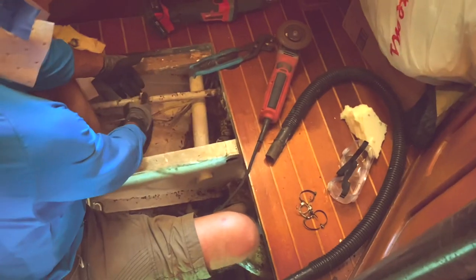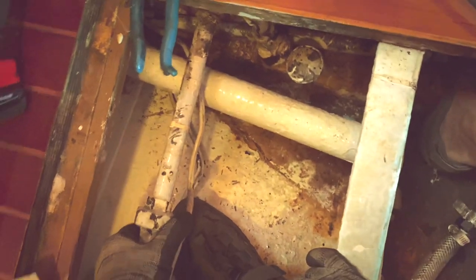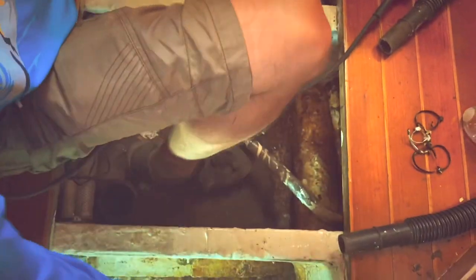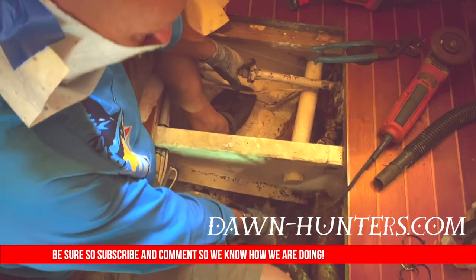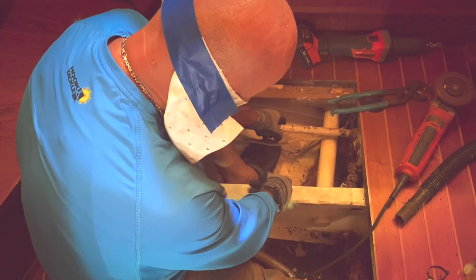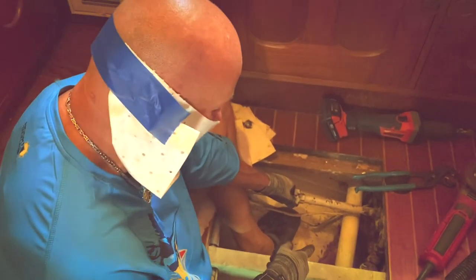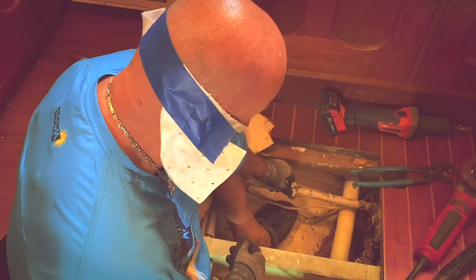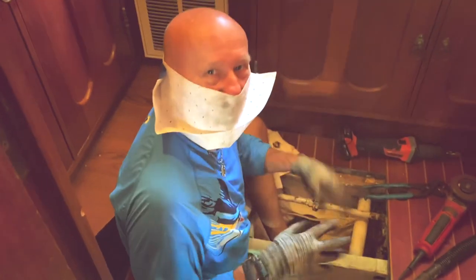I'm trying to take this connection off — look at the pipe, look what broke down here, broke out of the pipe. It's supposed to provide water that goes through this pipe and lubricates the seal. You don't need that anymore because of the new seal, but we're still going to lubricate — I'll put a new one here because this one looks like it was glued. This is why you check everything out when the boat's on the water, because if this had broken while we're going, it's almost impossible to repair. I was afraid of that when I surveyed the boat — this was something I moved and I saw it do that, and I didn't want to touch it.